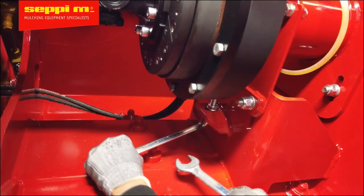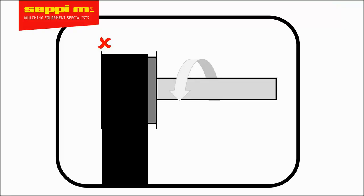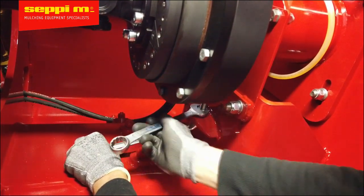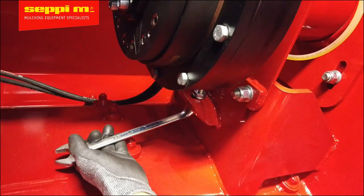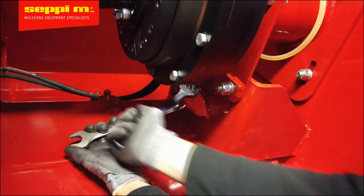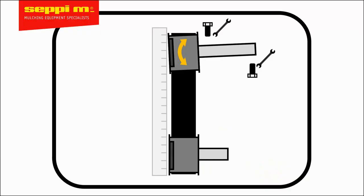Now we can get to the fine-tuning. If the belt shifted towards the outside of the machine, the adjustment bolt will have to be turned in to change the angle of the extension shaft. If the belt shifts towards the center of the machine, the adjustment bolt needs to be released, but be sure to have the counter nut tight. If the belt looks like it's already pushing against the pulley, or even after the adjustment it didn't shift at all, keep changing the setting of the adjustment bolt.